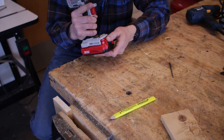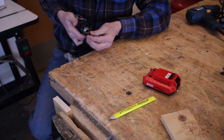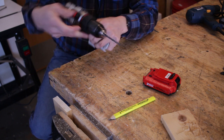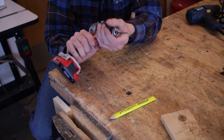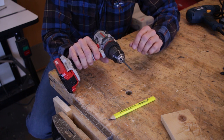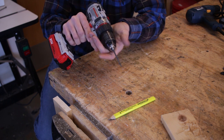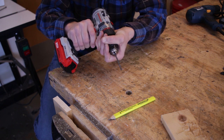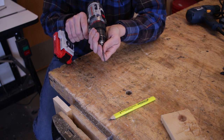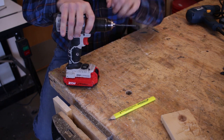For a cordless drill, we install a bit the same way — pop the battery out, slide the bit into the chuck, and spin it closed until it locks in place and tighten it. You'll commonly see people using the power of the drill to loosen or tighten the bit — it's common practice, but I encourage students to stay away from it because it can be dangerous. If you do it: hold the chuck away from the bit, set it to reverse, and gently squeeze the trigger until the chuck breaks loose. To tighten, hold the chuck and squeeze in the forward direction gently until it starts to tighten.